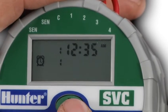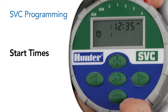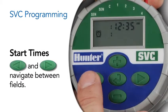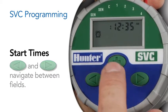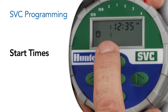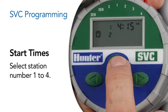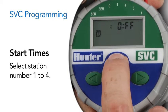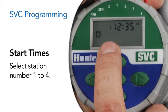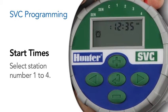Now we're on start times, and what we'll see on the screen is the time 12:35 a.m. is flashing. Remember, we can use the right arrow and left arrow to navigate around the screen. I hit the right arrow and the bottom number 1 is flashing. This is a 4-station controller, so I can use the plus to go to station 2, the plus to station 3, and the plus to station 4, and use the plus to go back to station 1. The bottom of the 2 numbers is the station or valve number.